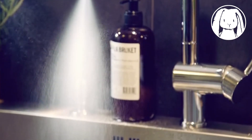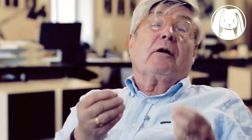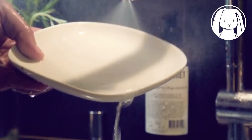So how do we save 98% of the water without losing functionality? The trick is in atomization — you break up the water into millions of droplets, basically creating a heavy mist. With our mist, you're getting contact with a much greater percentage of the water, almost all of it. That's why you can wash your hands and do your dishes with just a fraction of the water coming out of your tap.